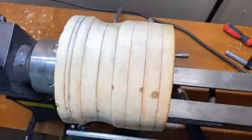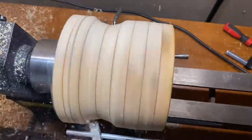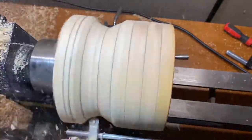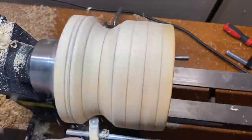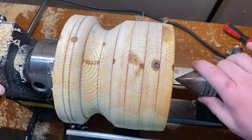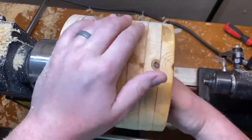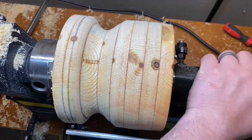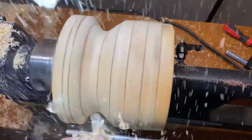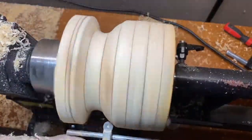Now that we've got the inside done, I'm starting on the outside profile again. I've got some marks on there that I've already cut most of them off - the pencil marks are just ending points to kind of help guide me. Here I'm taking the tailstock and going to put a blunt live center in it, and I put a piece of foam in there so I could have tailstock support pressing against the bottom. I didn't want it to fly off at me again, so I wanted to make sure I had tailstock support.